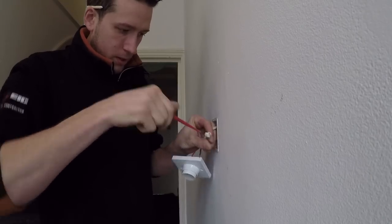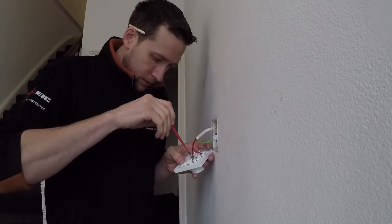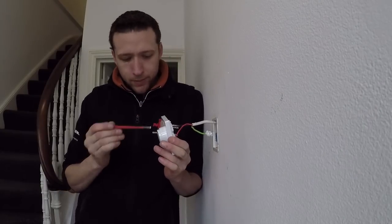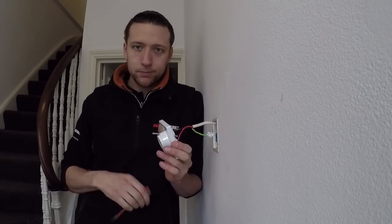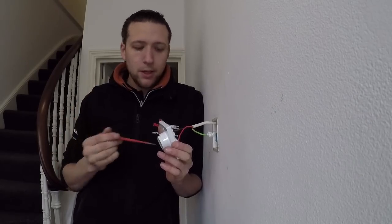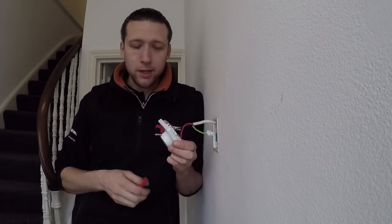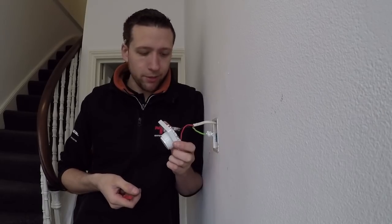Connector block on earth cable — done. Increase the timer on the screw. Once you've adjusted the timer on the screw, it's basically just a question of pressing it, seeing how long it keeps the lights on for, and then you just adjust it. That's nowhere near long enough — you just keep doing it like this until you find a setting that works for the application you're using it for.